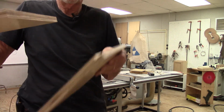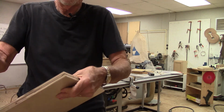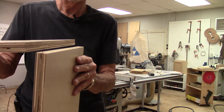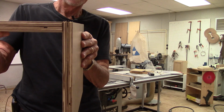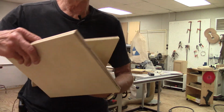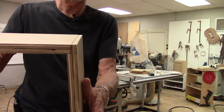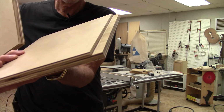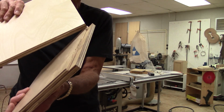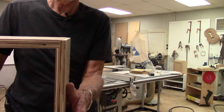This would be a butt joint, right? Or this would be a butt joint, right? A rabbet joint, you've got a shoulder to index it on, and you've got more glue surface besides just the end and what you're contacting, and you've gotten rid of the pre-finish. This is pre-finished maple, so you can actually glue to something, and you've got the shoulder to glue to and support it.